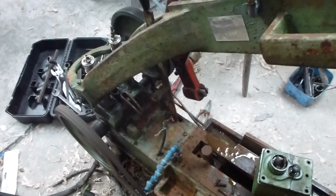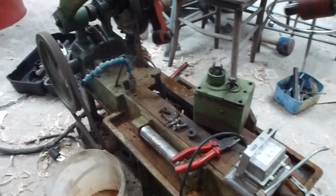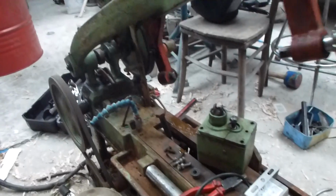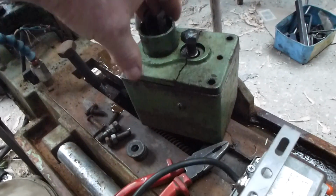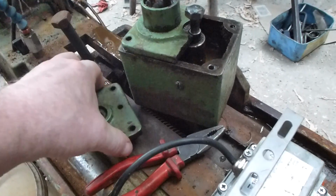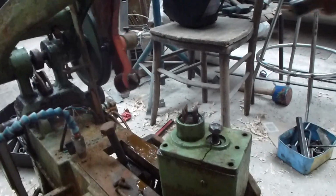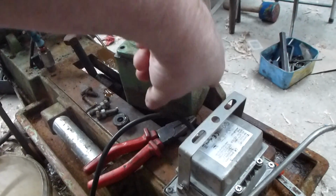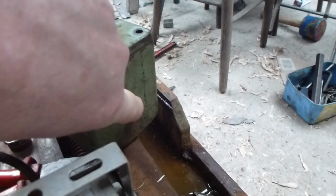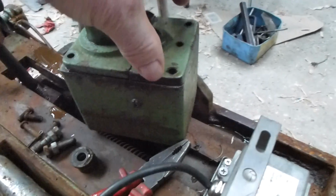The suds pump worked. It's not working at the moment, but that's a question of priming it. So the suds pump worked, but I had to do a little bit to free up the dashpots, the cover of which is broken in half. I suspect that it had water in it, and broke. The top cracked across here, and there's also down the side another crack, which looks like frost damage to me. Anyway, those are all repairable.